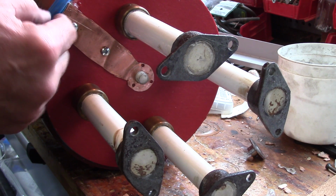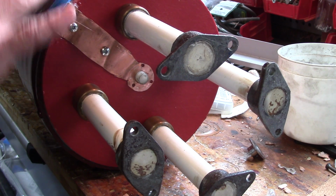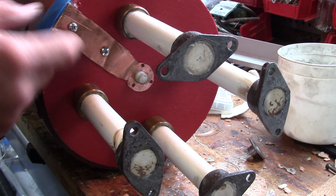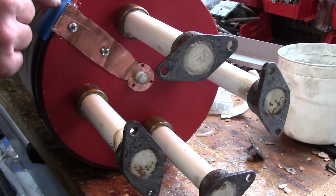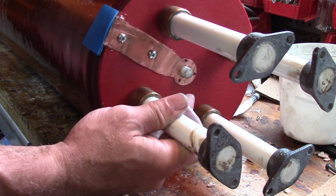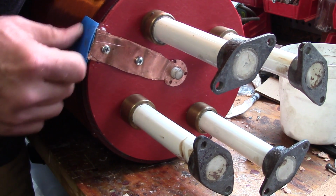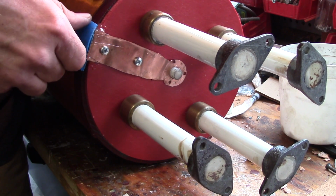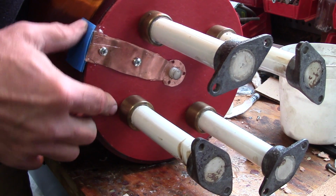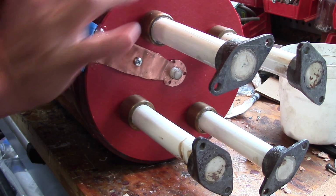And if I was going to do this again, I would not just simply solder the last turn onto here. I would make a plate that probably sat this way so that it was impervious to being moved. The problem is if this thing moves, the connection is severed and I have to resolder it. And I've had to do that several times now. So I resoldered it yesterday, and I epoxied it a lot, and then I just found this piece of corrugated plastic and epoxied that on there, and that should protect it. I don't think it's going anywhere, but it looks ugly now, so I'm going to have to find a way to cover this so it's not seen.